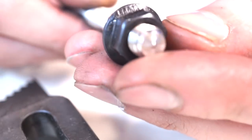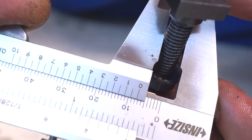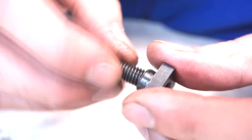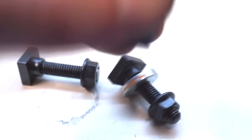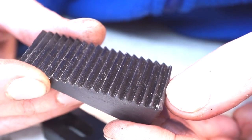Speaking of screws — the mounting screws and nuts are disappointing. The four larger grey mounting screws are pretty good, but the four smaller black ones for mounting the chuck on the table are terrible. They are all supposed to be metric M8, but just look at the thread diameter — it's about 7.5mm, so of course there is free space between the nut and screw. I will probably make new ones. The screws also easily unscrew from the T-nut. In Europe we use a 13mm key width for M8 nuts, but in England they apparently use 12mm — and only one of the eight nuts is 13mm, all others are 12mm. All the screws that came with it are really bad, like they used every piece of trash they found on the floor. The clamping accessories are also not the best — there is no end finishing and the grooves are not cut parallel.